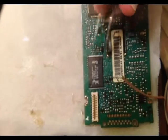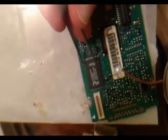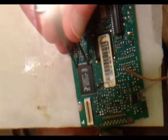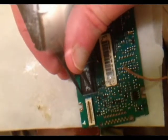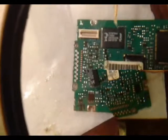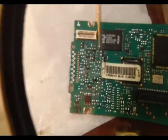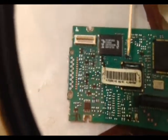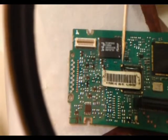Next, place the chip on the board, lining up all the pins correctly with the pads. You'll want a magnifying glass or something to make sure that it's lining up correctly. Once it lines up correctly, you'll want to solder it back on the board using the drag soldering method. You'll have to look that up and practice it separately — I suggest using a junk chip or board to practice with.